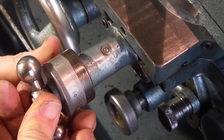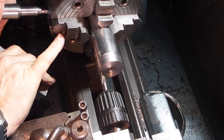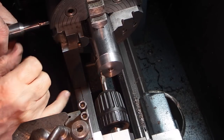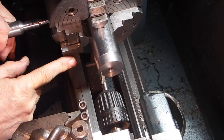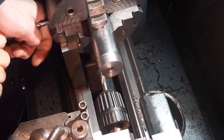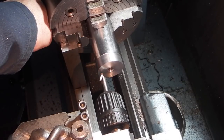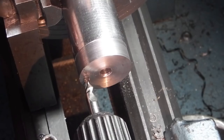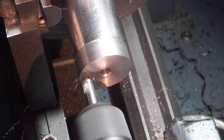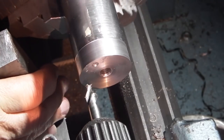Wind the cross slide out 13mm and reset to zero. I found a piece of metal that I'm putting under the chuck jaw — I want to put four holes round this. I'm using the chuck jaw onto this block as a stop. I've used the chuck key just to hold the chuck onto that. I'll fit in my drill, electric drill on the end — I'm just going to spot these four positions, then index round to the second position.